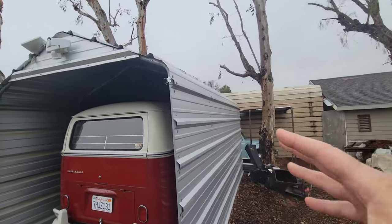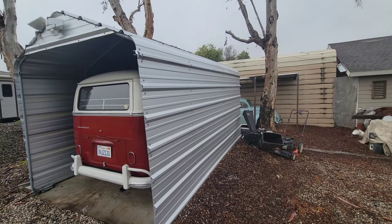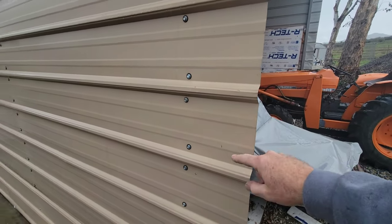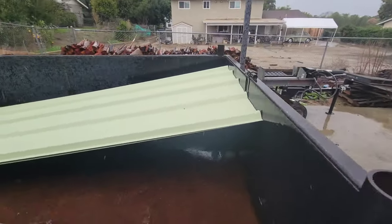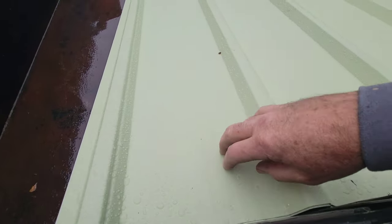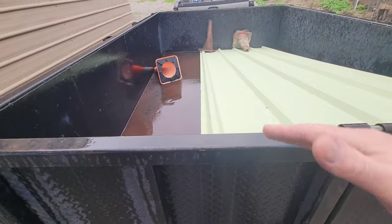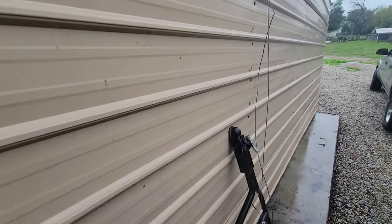If you put these PBRs on going vertical you'd lose all your strength because they're very flimsy from side to side. Looking at some off here - these are PBRs. This one is a different profile: it has a bump there in two of these. This one that I just got is flat, and you can't really see because it's got rain all over, but there are three bumps in the middle and it's flat on top. These are even a different profile, so you can get them in different ones. I'll be showing you the machines to make them a little bit later.